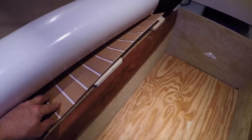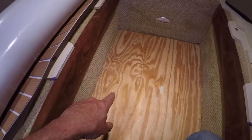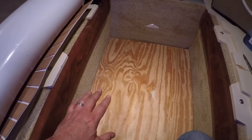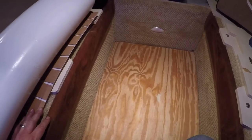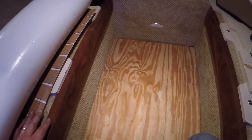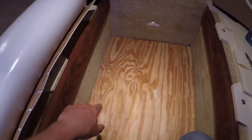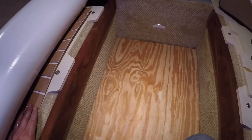But I won't put this down until I glass-resin the entire board. I'm going to resin both the top side and the bottom and the sides so that we don't get any more moisture issues and the board doesn't warp. It'll probably also help with the surface adhering to the resin rather than just bare wood. So that's the plan.